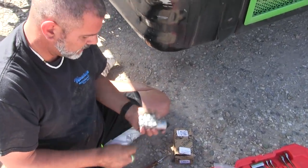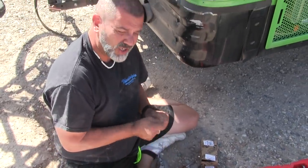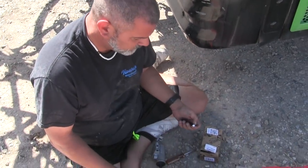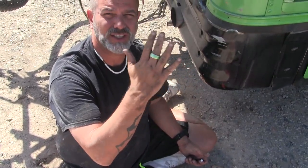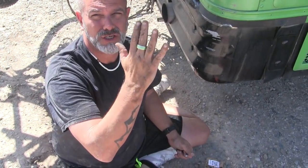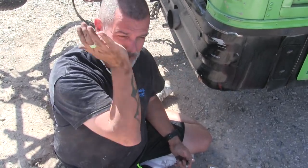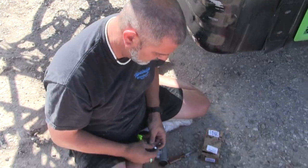Heck yeah. So what this actually controls, it mechanically controls the air dryer and the purge. So, for instance, what the purge is for specifically is for when you reach 110 pounds or 125 pounds, depending on what it's set at, it goes psh while you're driving. So it mechanically keeps the air pressure at a specific amount so you don't blow up your tanks and you can still brake and all that stuff. That's its sole purpose in life.